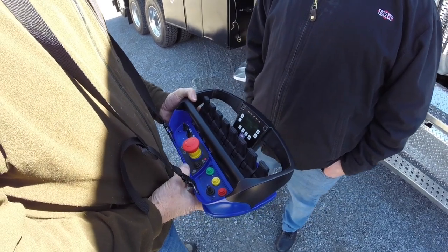Your switch in the middle is going to be your start and stop. Press and hold to the left for start; press and hold to the right for stop. Your RPM plus and minus is not used. The battery on the back of the transmitter is replaceable, with roughly eight hours of full runtime. It does not have a memory.